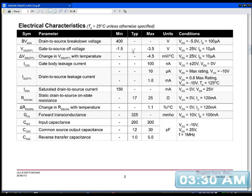Yeah, well that's great, it's ideal because that's within the range of that LED that's going to be supplying the voltage, because I'm basically using the voltage across an LED, and it's well within that range. As long as it's between 1.5 and 3.5, it's going to work fine. And it's 10 microamps, bloody hell, it doesn't use much current at all, so once that capacitor is charged up, it's going to basically stay off for ages. Unless I use a leaky electrolytic.